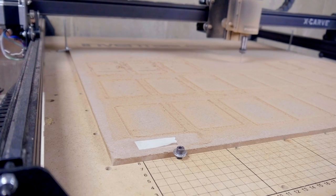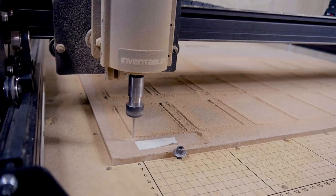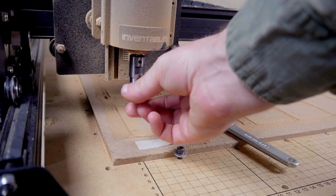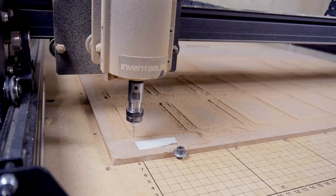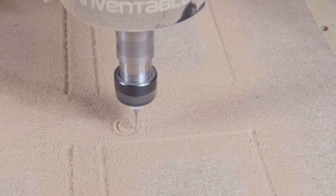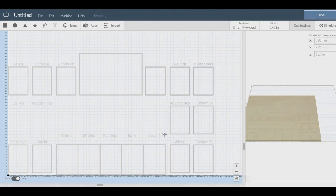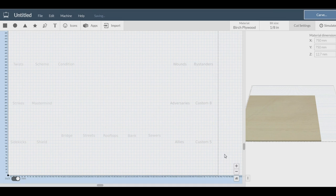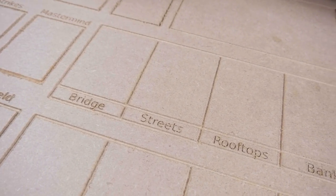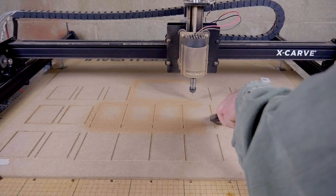From this, I learned it's a good idea to put down a piece of masking tape and use one of the corners as a zero point. If the cut gets interrupted, I now know precisely where to resume cutting from. For this design, I know the cut will be interrupted because once I've cut out all the borders for the card spaces, I need to switch to a smaller bit to cut the finer details. Easel is smart enough to know that if I tell it I'm cutting with a large bit, it will be too large to precisely cut the lettering in my design, so it only cuts the card spaces. Once it has completed cutting all the larger details, I simply go back into the program, delete all the sections that have already been cut, and tell Easel that I have installed a smaller cutting bit. The smaller bit is zeroed on the corner of my tape, and cutting is resumed to finish my test. The result was really quite good despite the errors I caused. I did a second test just to be sure on the back side of the board, and I think I'm ready to cut the real thing.